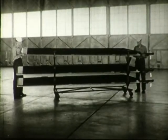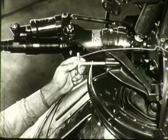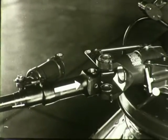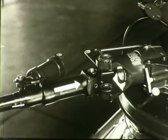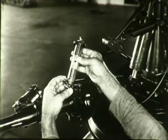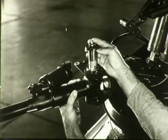Blades must always be installed in balanced sets of three. If the pitch lock pins have been removed, they must be reinstalled. Slide the root end of the blade into place in the end of the pitch bearing housing. Support the blade and insert the bearing washer under the head of the vertical pin. Then carefully insert the pin into place from the top of the pitch bearing housing.